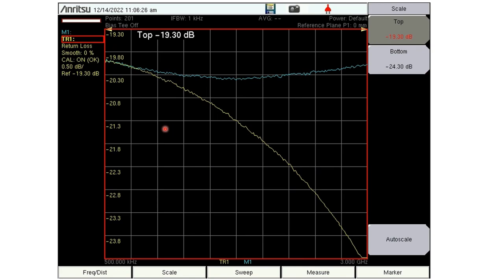I've calibrated the handheld VNA and placed a 20 dB offset, and measured it — that's the blue trace you see here. It's pretty close to 20 dB, which is what we expect when a handheld VNA has been calibrated correctly. Next, I took the off-the-shelf cheap calibration kit and used it to calibrate the instrument, but I did not change the calibration kit setting in the instrument. So according to the instrument, it thought it was still using our standard OSL calibration kit. As you can see — the yellow trace — the performance drops dramatically. This calibration kit was rated for 3 GHz, so we did not go beyond its capability. What was different was the handheld VNA did not know I was using a different calibration kit than what it was expecting.